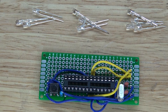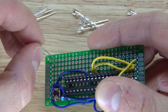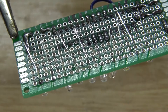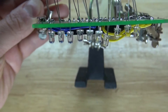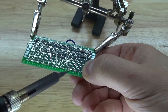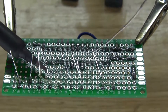Starting with the LEDs: connect the anodes closest to the circuit and align all the cathodes in a line for the common ground. Place them into the perf board, then solder one pin into place first. Since the LEDs may be uneven, melt that single solder point and push them flush against the board. Once aligned, solder the second pin into place to complete the solder.